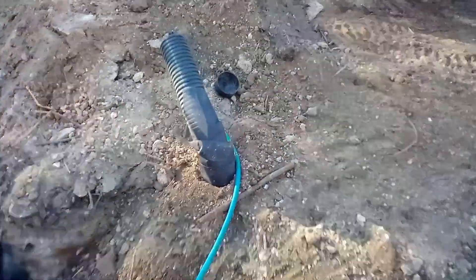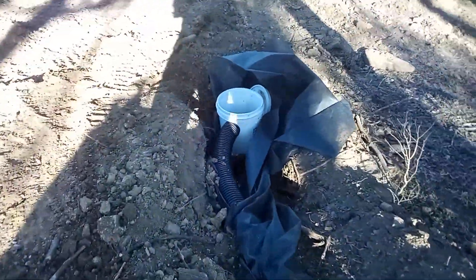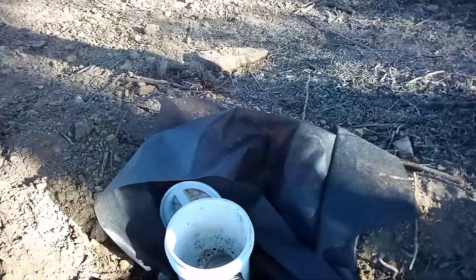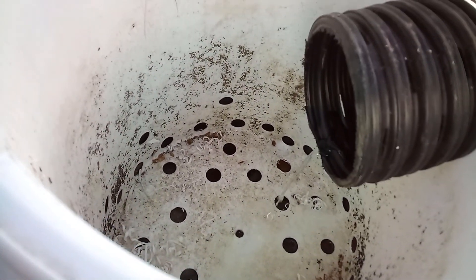This video testing the dry well is a little out of time sequence, so I'll put more corrugated drain pipe in the berm that will tie into the pipe where the water hose is now. I like to terminate my French drains like this with a 5-gallon bucket with a screw-off lid because it keeps the opening clear of dirt, debris, small animals, and insects to some degree.